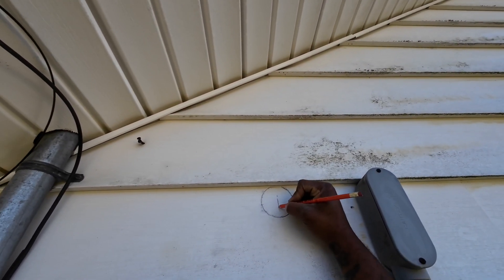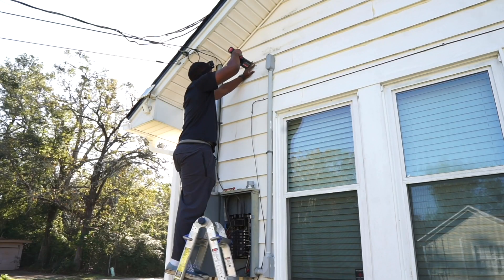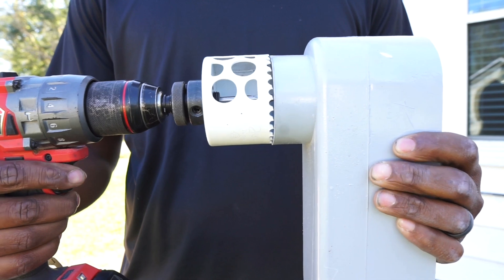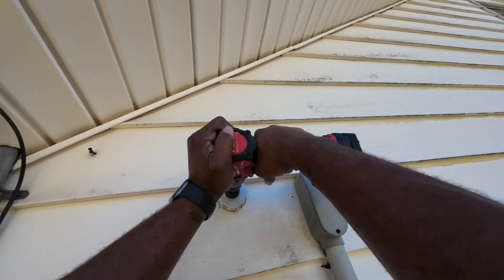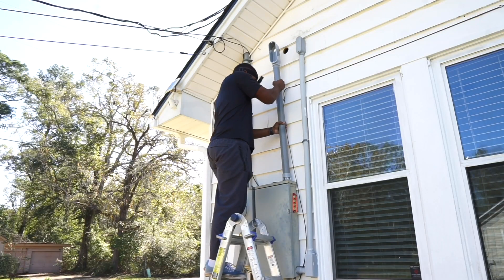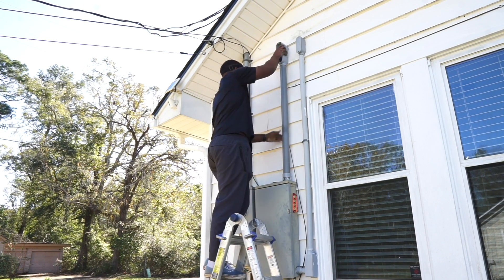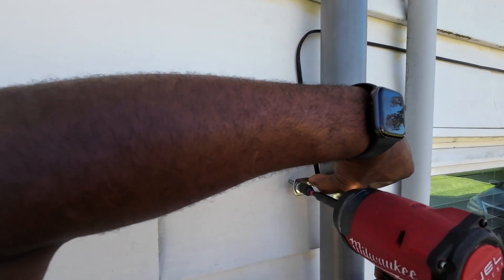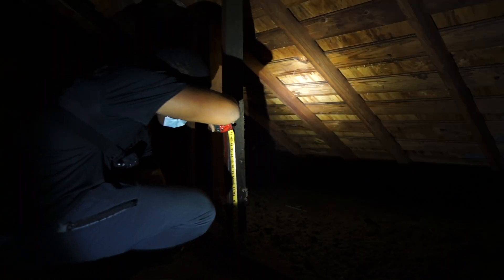I will be using a bell bit to get through the first time. I did go in the attic to make sure I didn't have any studs. This is the hole saw we'll be using — typically I like to have the hole saw over the lip of the LB, but this is the only one I had. It worked out perfectly, everything seated the way it needed to be. Now that I have access, if I ever want to run more dedicated circuits, this is where I'll do it from, with my LB and conduit being two inches.